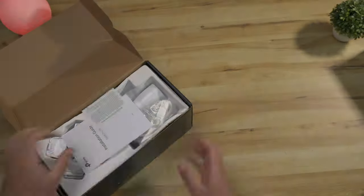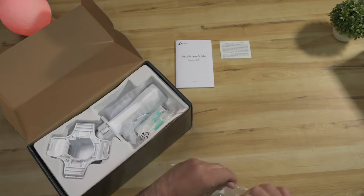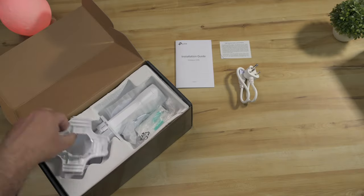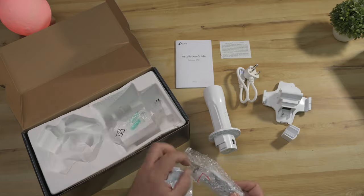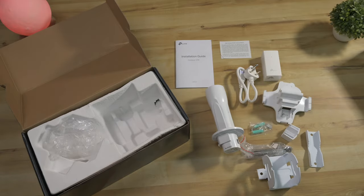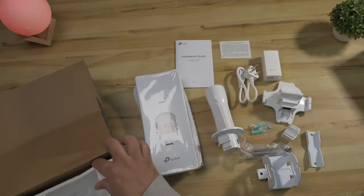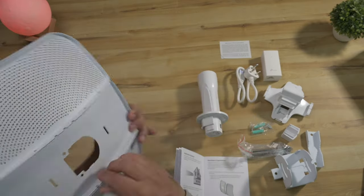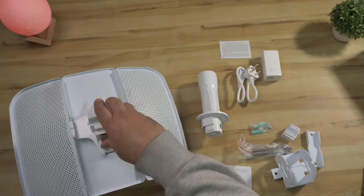The idea is quite simple. One of these radios acts as an access point whilst the other is its client. They establish either a 2.4 GHz or a 5 GHz network, depending on the model. The CPE-610 establishes a 5 GHz connection between the two radios and they can then communicate with each other, with the throughput being up to 300 Mbps. So pay attention here when selecting a radio to not confuse that spec with the maximum speed you will get on the client side to your end devices.